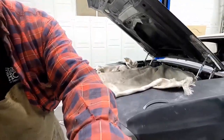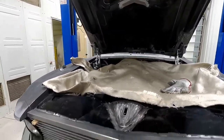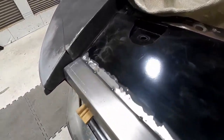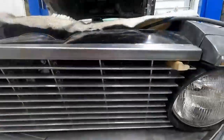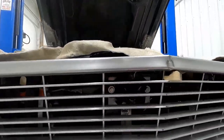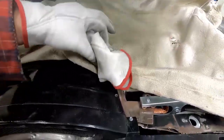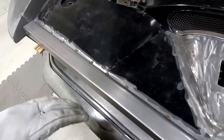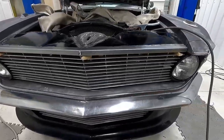I'll give you a close-up. I'll take a few tacks in there to get it all squared up — it'll stay in place now. You see that lip hooks right under that first fin. Real nice. That'll be solid. I don't have to put any fasteners in that way. This comes off, the whole unit should slide forward. It should be a nice setup. I'm going to go ahead and remove it, then cut the back off and start welding.